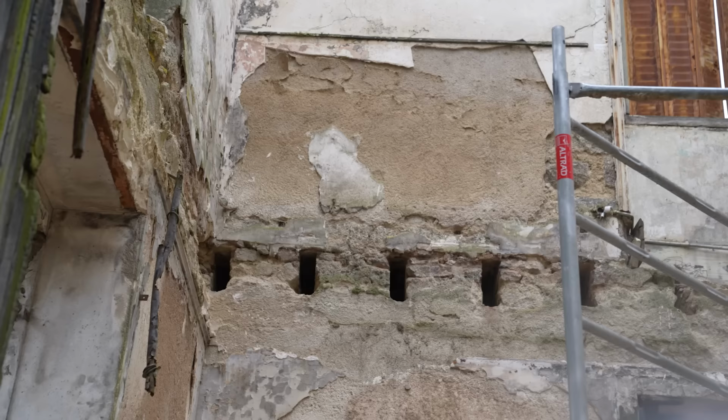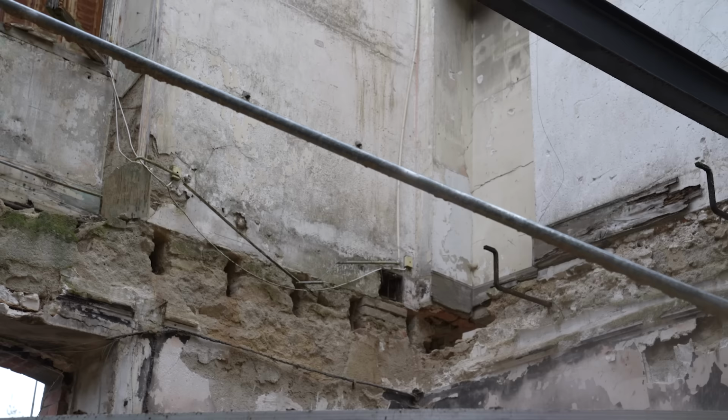So you can see normally what we would have done in the past was clear out all these pockets, chisel them and start putting the wooden beams in. But the new way we're going to do it is putting a C-section of steel onto the wall so it's in each end and bolted to the wall, and then all the beams will slot into that. It stops them having to go into the wall and chance of rotting, and it makes everything a lot slicker, a lot more level, just a lot better overall. So let's get this first C-section in the floor above.